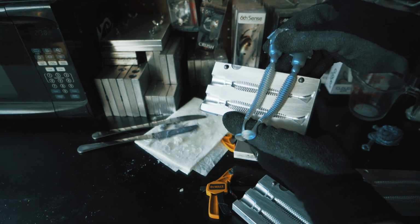A lot of times, you know, you have that blue or that silver in those shad, and as you move them around in the sun, that has that shimmer and shine on it, and that's what that pearl powder is going to do. Now, when you're using pearl powders, a little goes a long way. You're definitely going to want to start off with a very small amount and then add as needed, because you can overdo it really, really fast. So just remember, when you're using pearls, a little goes a long way.